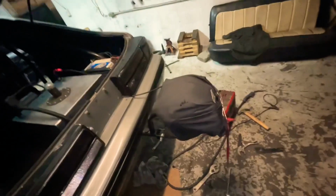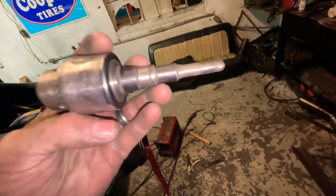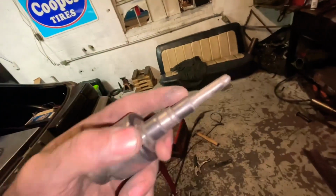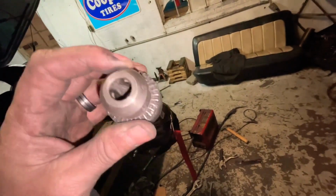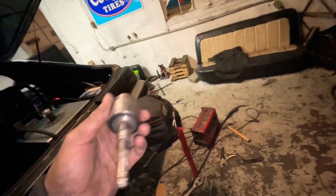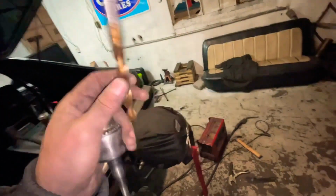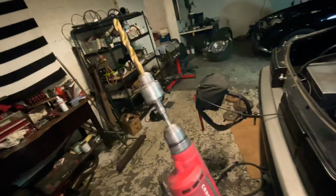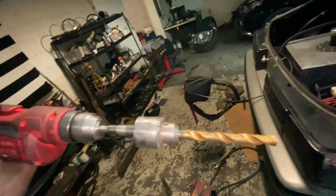since my bigger drill broke, I figured I'd build this right here. Look at this. Took the head of it out, stuck a drill bit in backwards into my drill, and I spun it backwards against my grinder to get that somewhat straight. So now I can use these bigger bits I ain't never used with the bigger shanks on it, because now they'll fit. I ain't never seen nothing like that, have you? Look at that. Works like a champ. So I've been using it for my hole saw, my drill adapter.